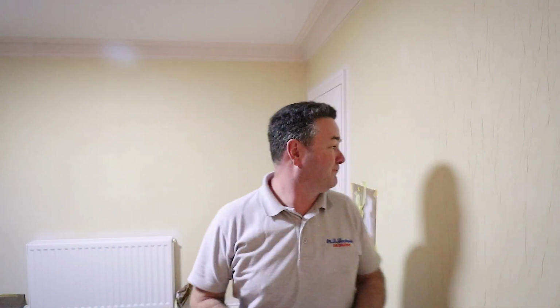Now, I was using the QT5 HVLP. I was spraying fine, got a bit of a blockage, had a bit of a nightmare, managed to rectify it and clean the blockage out, and it started spraying again. But I came back in today and I ran my hand over the woodwork, and I'm not kidding, even though I strained that paint through a little vegetable bag, it wasn't fine enough filtration. There were little bits still over the woodwork.